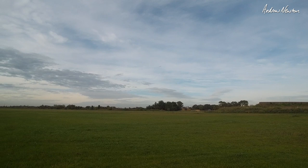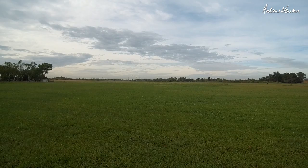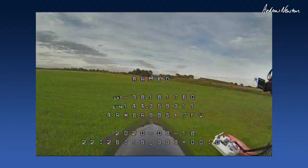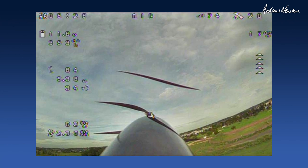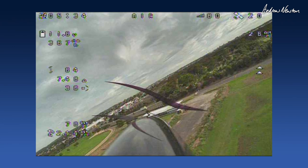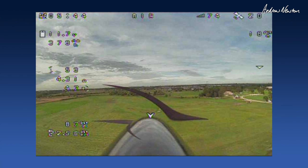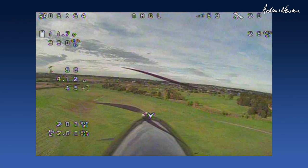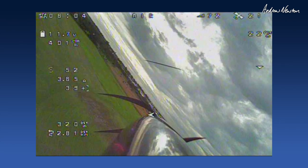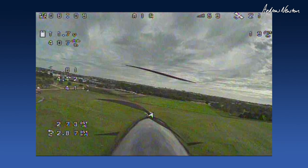Let's have a look at the FPV. Still gliding nicely — a little too nicely. It's full throttle but very mild performance. Goggles down — that looks good, very good. Angle mode looks pretty good. Altitude holding pretty steady, wanders around a bit but I'm not fussed about that. The current is only 3 amps — that's cool. Let's try altitude hold at 21 meters and see if it holds there. Doing pretty well.